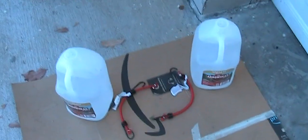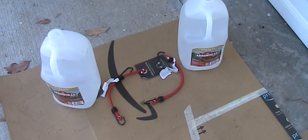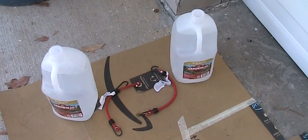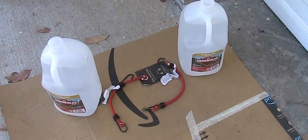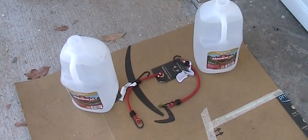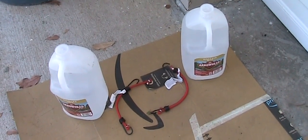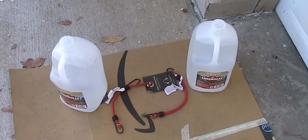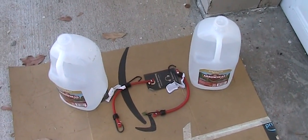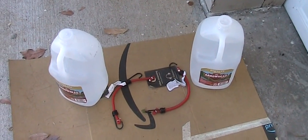Okay, this is what I'm going to do. I'm going to use 2 water bottles filled with water. Each one weighs about 8 pounds. 2 is about 16 pounds. And I put a little bit less water, so it should be around 15 pounds. If you want to be precise, you can weigh it to be exact. And after that, I will tie it up and hang it on the garage opener to do a test, to make sure the garage opener can lift it up and doesn't perform badly, like struggling to open or closing very fast. And then I will do the installation. I don't want, after I do all the installation, the garage door to be too heavy and cannot be lifted, and I have to undo everything, plus even fix the garage opener or the spring and so forth.